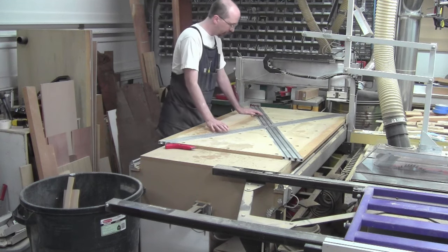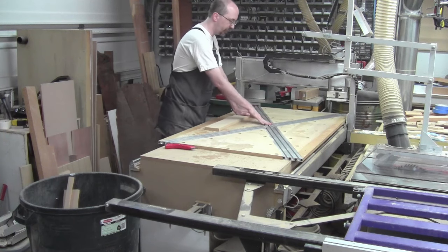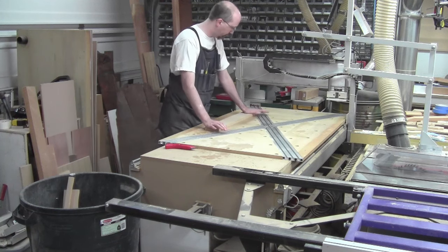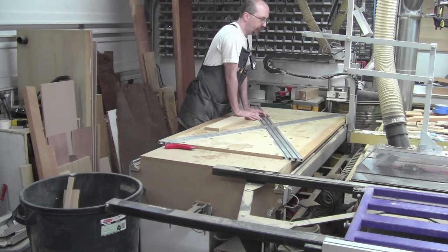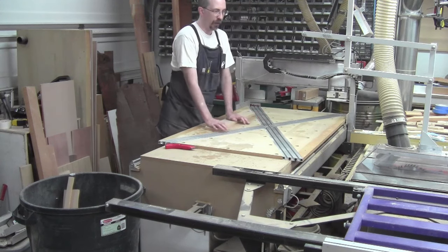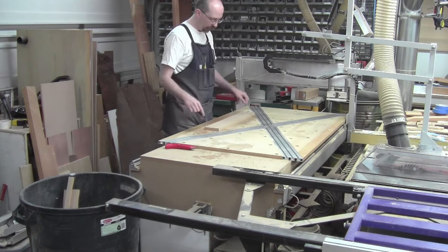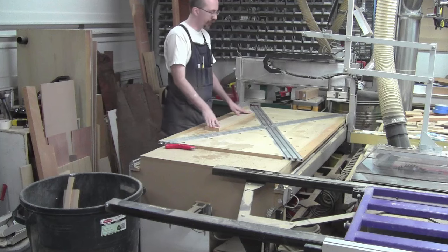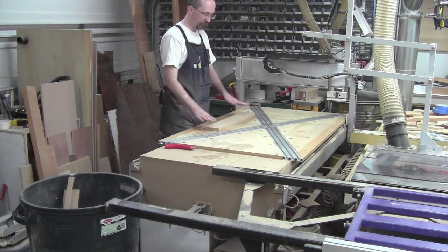And this will be like my second permanent fixture for the CNC. The other one is where I put the vise, for branding irons and stuff, but for this one we're just going to go straight through. I'm going to do all of the holes through. That's what I'll do. Yeah, that'll work. And that way it'll hold it, and I have locating pins, so it'll always go back in the same place every single time. And that should take care of keeping things aligned and centered.